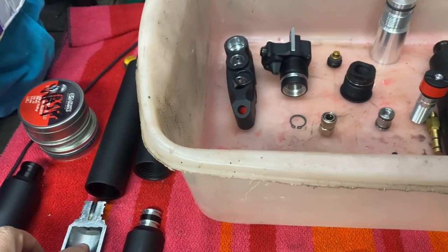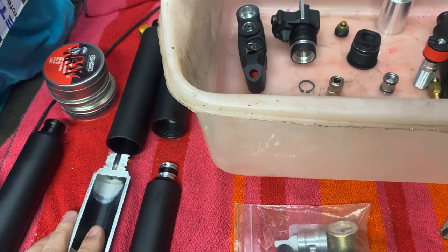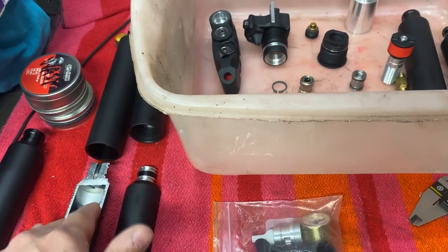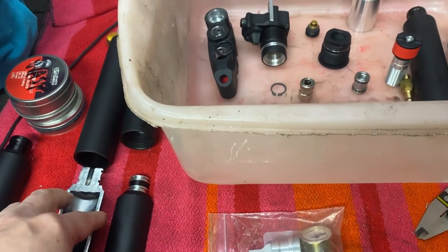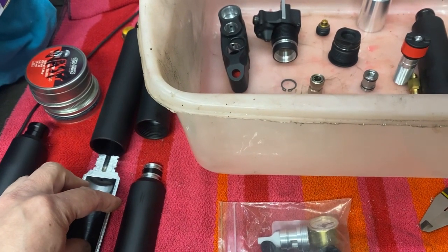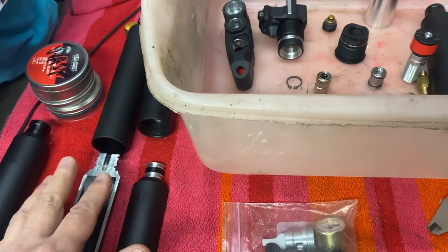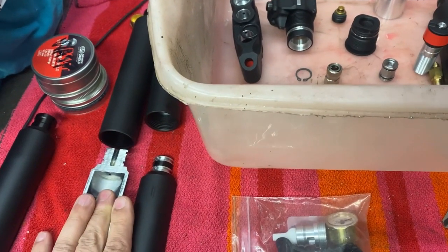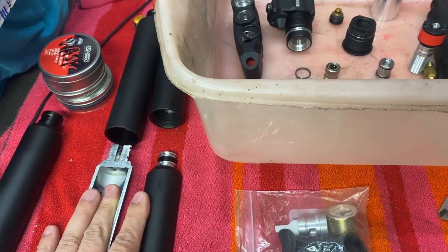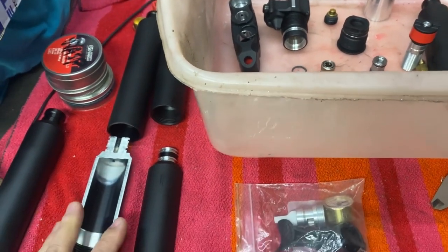and when you fill the gun, the parts per volume of oxygen in the cylinder is much higher, because it's condensed in there, so there's much more oxygen in the air than in the breathing air. So it might have auto-ignited something in the cylinder. When you apply pressure in the cylinder, it heats up because the air is compressed, and it can get pretty hot. But anyways, that's in the lab, and Edgun will tell people what's the outcome of that.